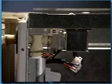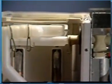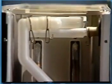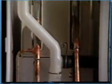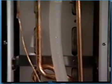When the power switch is turned to the ice position, the inlet water valve opens, allowing water to enter and fill the reservoir. The 1-minute fill cycle assures that the ice machine will not start until there is sufficient water, eliminating overheated pumps and compressor problems.